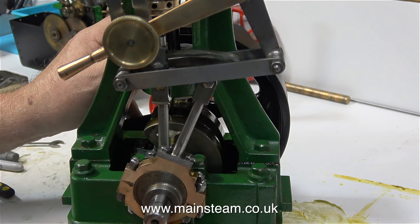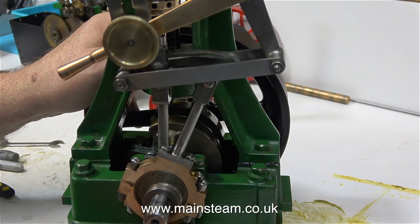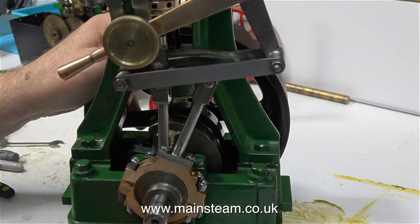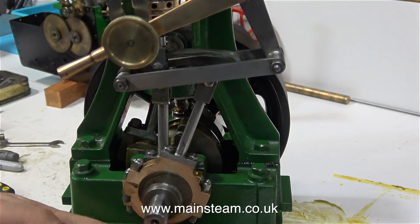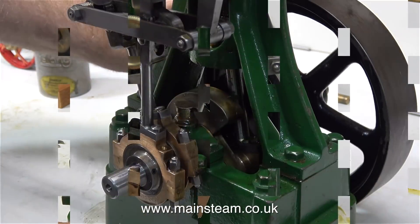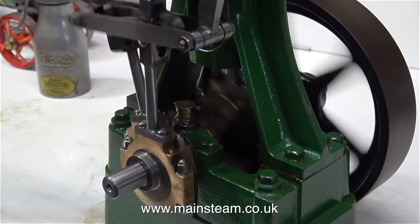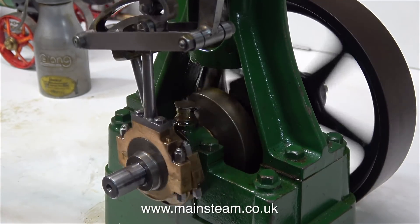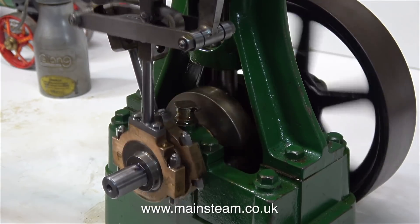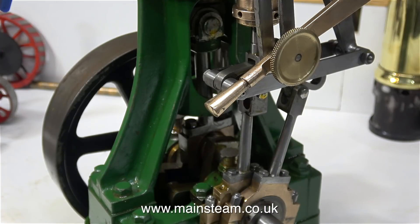A good rule of thumb — no pun intended — is that you need to be stronger than the engine. If you're struggling to hold the flywheel back as you rotate it while you test it, there's a good chance that you're going to get your thumb caught up in the works if the flywheel revolves suddenly and takes you by surprise. And after that dire warning, I think that's about it for this video. In fact that's it for this particular series, although you will see this engine again because I'm going to fit a mechanical lubricator and also a separate manual oil pump to lubricate the crosshead. So that's it for now — thanks for watching and I hope you found it useful.